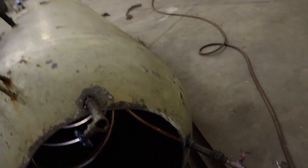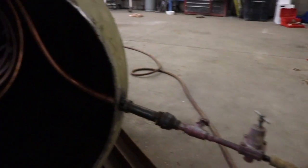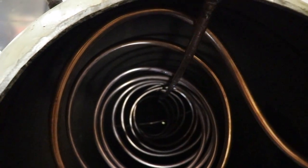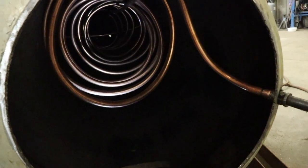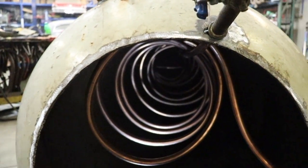Right now I'm just doing my pressure check on it, running about 25 PSI — that's kind of what it looks like when it's all done. I gave myself enough room, but I ended up having to sweat the fitting at the end again because it had a little pinhole leak. You've really got to think about that when you're building this kind of stuff: are you going to leave yourself access room to do your test? I would definitely say you better do that or you'll regret it.